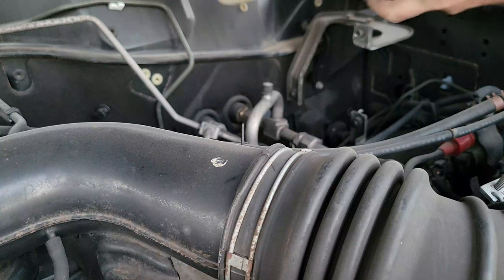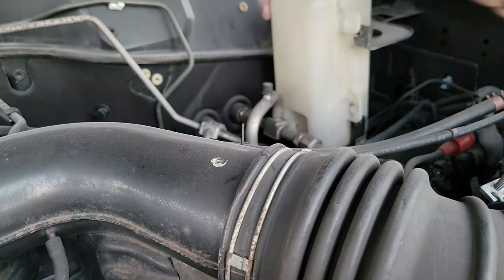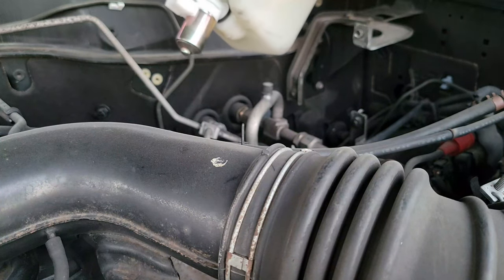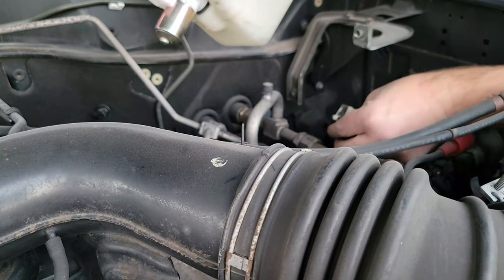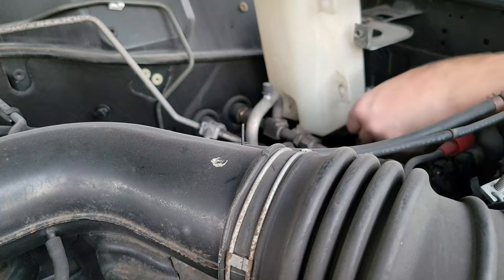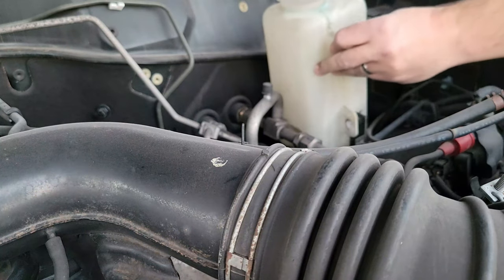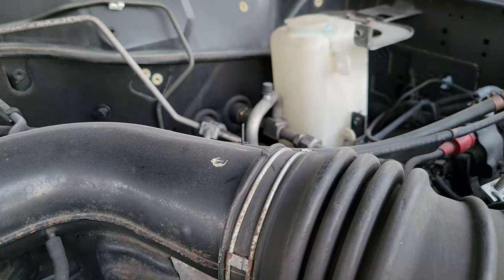Since there's a ton of space underneath, I don't need to worry about the pump height - just make sure it's good and sealed. The pump can hang in there - this is for the headlight washers, which are really a novelty. I get my wiring connection and hose accessible and identify the two bolts that hold this reservoir in. I get a ratchet to remove those since I put them on tight.